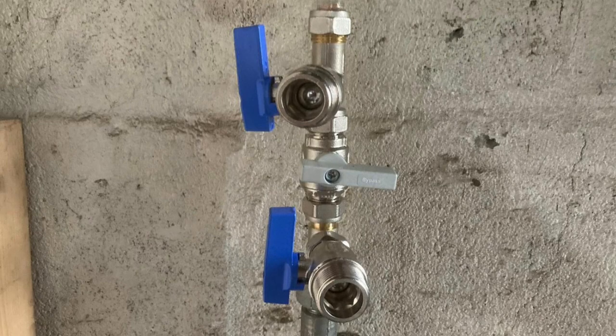I'm going to turn on the water at different stages until I can get to where I've got full flow again. Now that I've got the pipe cut back to where I think the restriction is, we're going to start assembling the new pipework and the new water softener. First of all I want to put that bypass set in, which is so valuable.